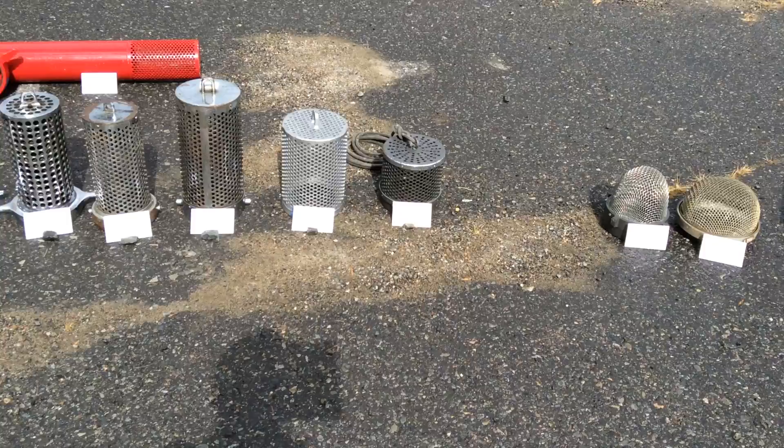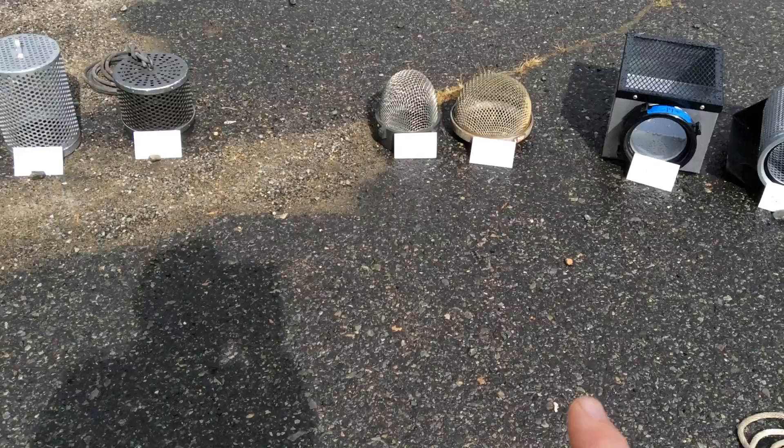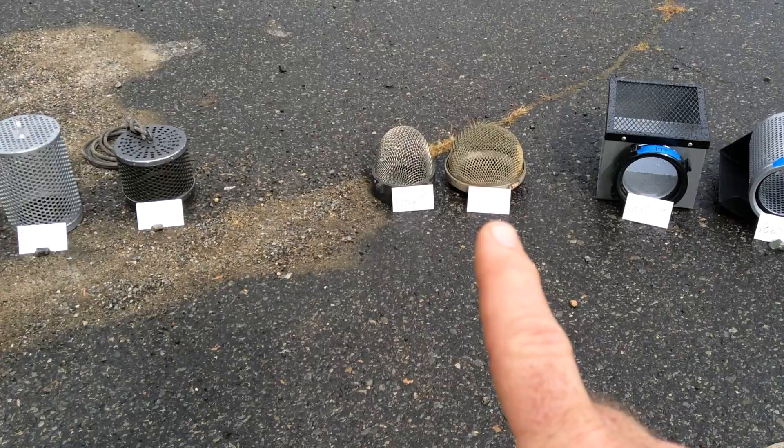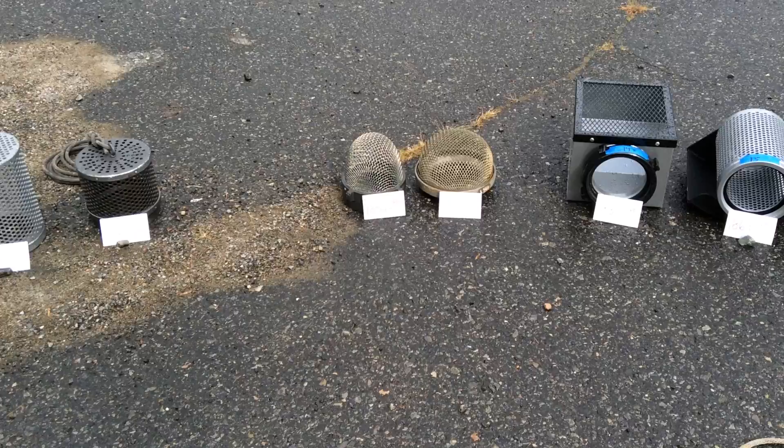The interesting thing is the short squat one was the highest flowing one, very similar to the basket strainers. If you look at the basket strainers, they were over 1800 gallons per minute — some people call those an acorn strainer. They flowed very well. That's a redhead, and that one we don't know — there's no name on it, although it does look like an acorn and it is very old. It came out of an old pump test facility.